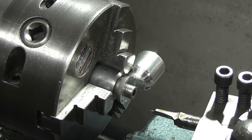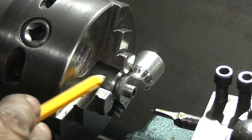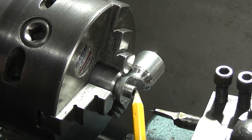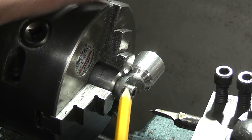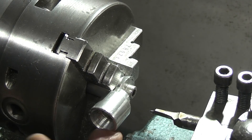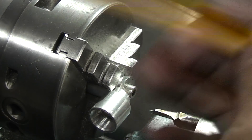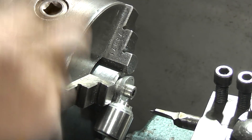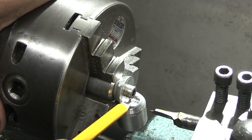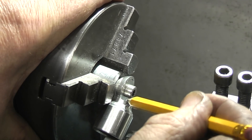Let me explain what I've done. I've taken the piece we made of this vertical which we halved, I've put a piece of aluminium in the chuck, drilled it, and then using a cap head I've fitted the spherical part onto the aluminium. Now to stop it twisting if it hits anything — this part is just touching the chuck so it's not going to revolve. What I'm doing is machining, as you can see on this part here, I'm just machining an internal diameter so that the spherical of the next part will fit.